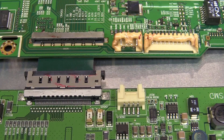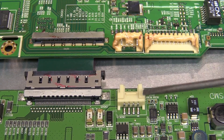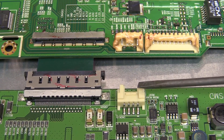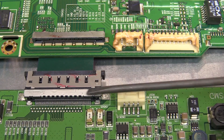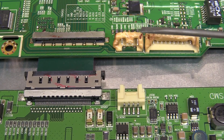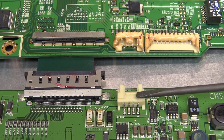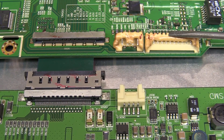That's the key to what's happened here. As a general rule, surface-mount connectors like this one - even though it looks almost identical to this one, apart from the melting - are designed using higher-temperature thermoplastics to actually survive the reflow soldering process used in surface-mount boards. And likewise with this high-density ribbon cable surface-mount connector, it's designed with plastics which are designed to survive the temperature profiles. These through-hole ones are clearly not as high a temperature rated, or for as long.